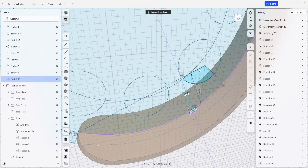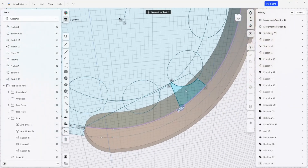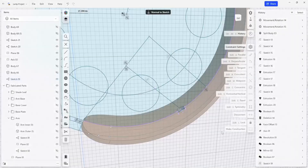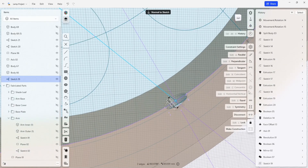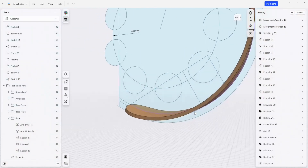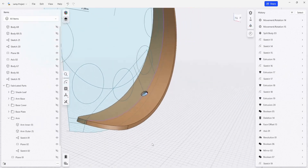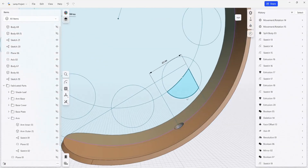I'm going to select these two edges and make sure that they're perpendicular. I'm also going to make this edge parallel to this edge. So now if we lay this flat edge along the drill table, we'll be able to drill a hole perfectly through in a perpendicular manner. I'm going to make this a round number as well, and that's going to help us with just keeping things organized.